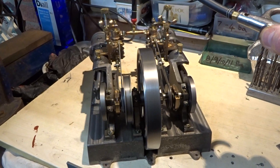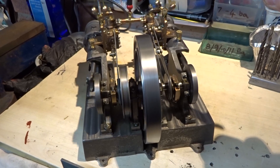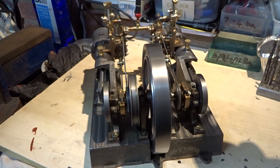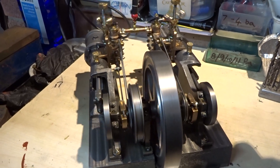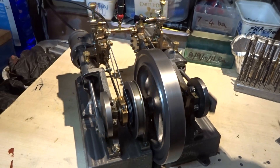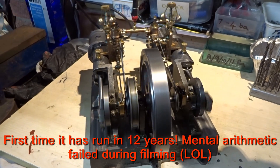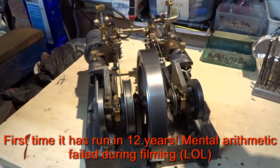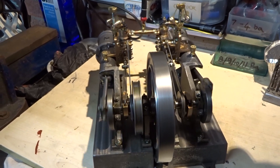The engine's never been run on steam and never will be. The reason is that it's cast iron cylinders and cast iron pistons, and I cannot be troubled at the prospect of trying to keep rusting at bay. This is probably the first time this thing has turned over in 17 years. Obviously if you steam it you are bound to get condensate left in the cylinders, and you have to be jolly sure you have cleaned it all out and got everything fully oiled up to avoid rusting.